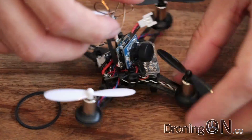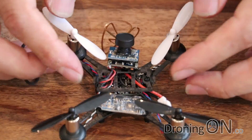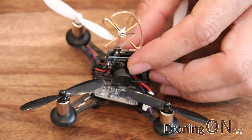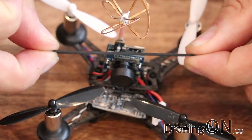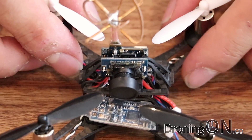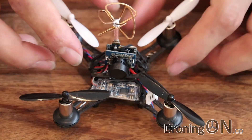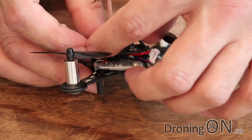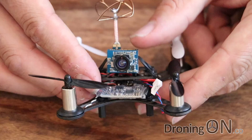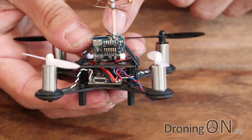On top, the camera and the VTX are not broken — they're meant to be loose. The reason is, if they were fixed permanently onto the frame, a crash might snap something. Instead, you take the spare elastic band that comes with the quadcopter, pass it over the middle of the VTX circuit board, and clip it onto the nodules on the side of the frame. If you crash, the camera unit just folds backwards rather than breaking. The camera is a 520 TVL CMOS camera with a wide angle lens, and the video transmitter is a 40-channel VTX.